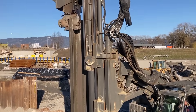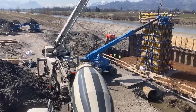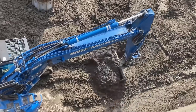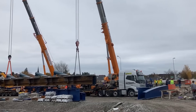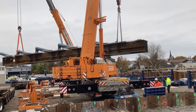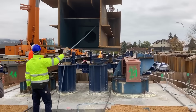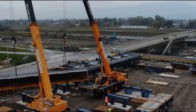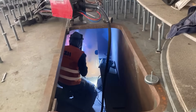The middle channel of the Rhine required additional shoring. Auxiliary piers were erected directly in the main channel of the river. The construction in this section was particularly challenging due to working in the danger area of the Rhine, but the team managed to overcome difficulties with professional expertise. The discharge capacity of the Rhine is to be expanded from 3,100 cubic meters per second to a maximum flow rate of 4,300 cubic meters per second. The 255-meter-long Rhine Bridge between Hard and Fussach must therefore be adapted to ensure the primary framework conditions for flood protection.